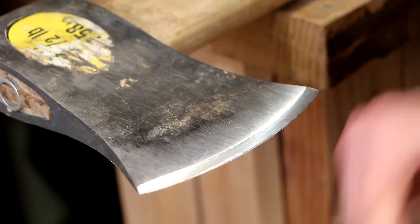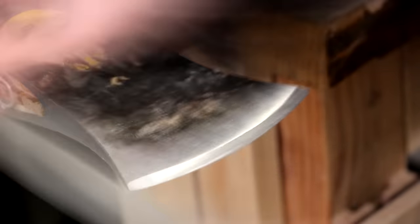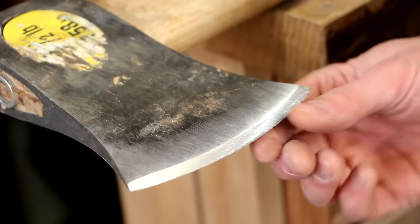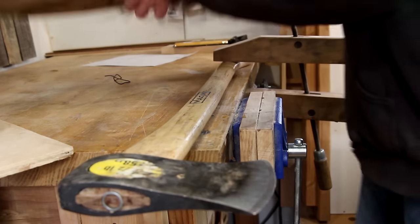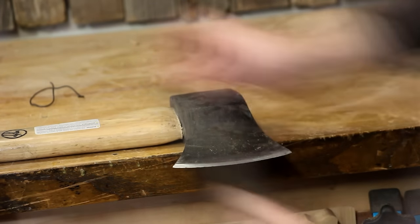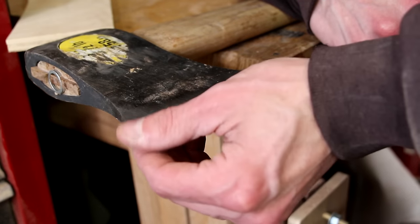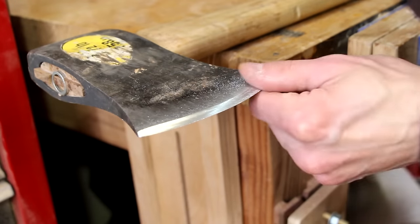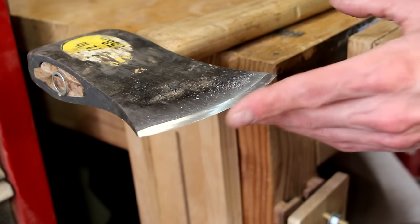You can start to see how quickly it actually starts cleaning up the blade. There are still some dings and deep scratches to get out. Once I've got most of the scratches out I'll flip the blade over and file on the other side. I'll keep flipping sides, making sure I file each side evenly — you don't want to file too much on one side or you'll end up with the point off center. The edges were really rounded over and it's taking a little more filing to get an edge there.